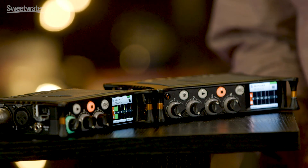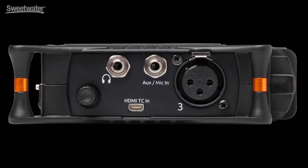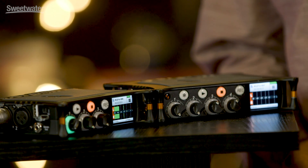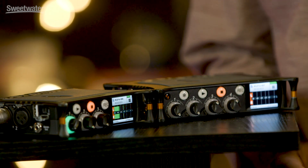Some really key features for videographers: these devices have an HDMI input. You might wonder why an audio recorder has an HDMI input — well, this allows us to auto record start/stop trigger from the camera. With compatible cameras such as the Sony A7S, A7R or Panasonic GH4, the MixPre can read the record flag coming down the HDMI cable and auto start the MixPre. This reduces the likelihood of forgetting to hit record on the MixPre itself, which can be very annoying especially if you've just done a great take.